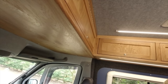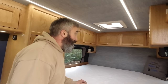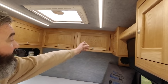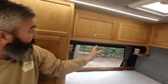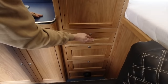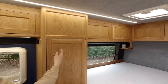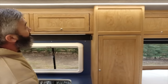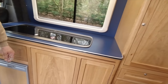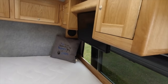I love the wood on there as well rather than the original material - it matches in with the rest of the cabinets. You've matched all the laminates as well. All the veneers are what's called book matching - so down the centre of each panel you can see the grain throws through. These panels in the drawers and the top panel were all cut out of one piece so the same grain runs straight through. Same on the fridge, same on this drawer - the bigger cupboards are all matched.